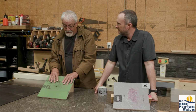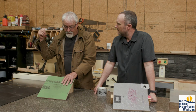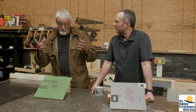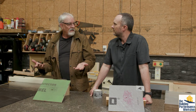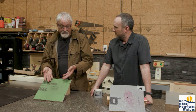Okay. I really don't. And as an example, I did a studio down the road here, and it's built kind of like this barn. We took down old barns to build this thing, and that's what they wanted, this old barn look. We even took down old metal off a barn and put on that. This metal had holes all in it. So we had Zip. We put the Grace Water Shield on top of that because I knew that roof was going to leak.